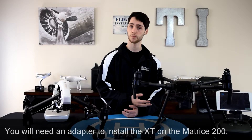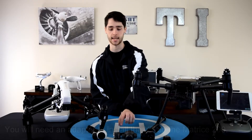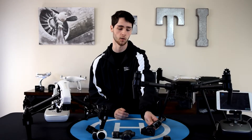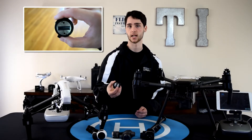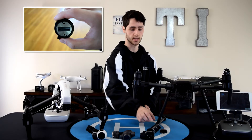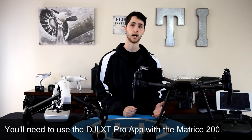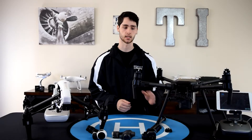The DJI Matrice 200 is a little different. The pinout on this one is one long series of pins, and the X4 fits the bottom of the Matrice. But the XT matches the bottom of the Inspire, so to work around that, there's a mount adapter you have to get separately, designed specifically to convert the bottom of the Matrice to the same connector the XT uses. Once you install this adapter on the bottom of the Matrice 200, it's like installing the XT on the Inspire — the bottoms now match. The only other difference is that you have to use a separate app specific for the XT on the Matrice 200.